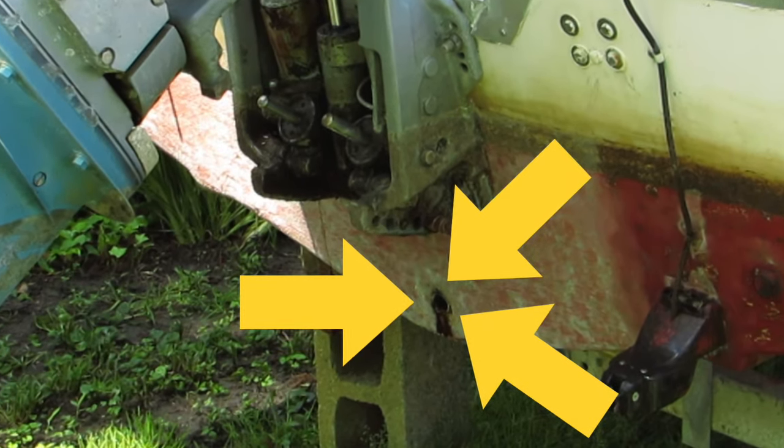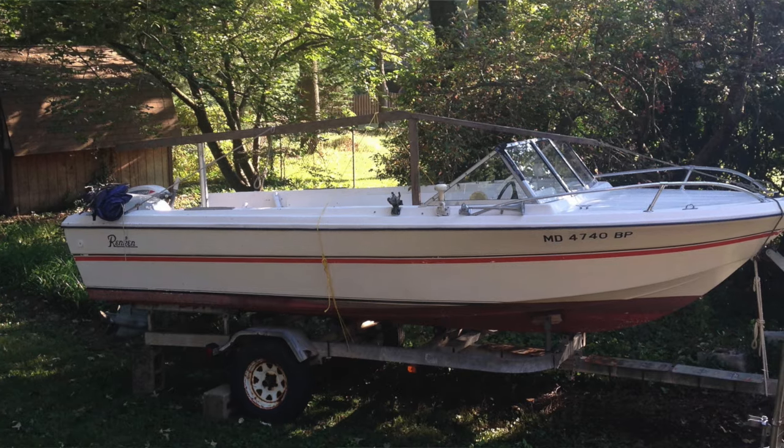Step number one: you want to prevent ice from forming in the bilge. With your boat up on the trailer, remove your drain plug if you haven't already done so. Leave the drain plug out all winter so any water that collects in the bilge from condensation drains out the back. With smaller boats, it's a good idea to jack up the front of the trailer to tip the bow up a little, which allows more water to flow out the back. Make sure before you're finished that the bow is tipped upward so water drains out, because you do not want water and ice forming in the bilge or on the floor of your boat.